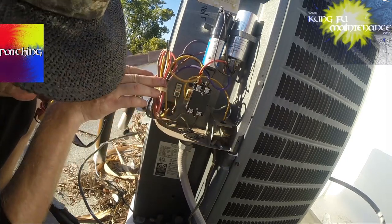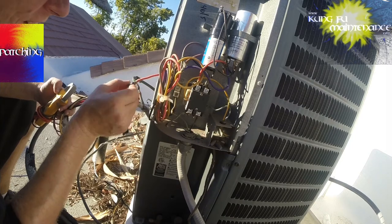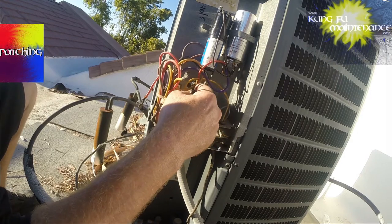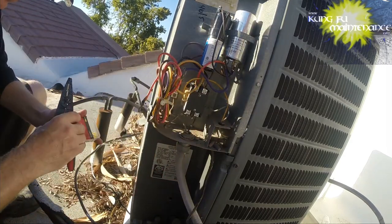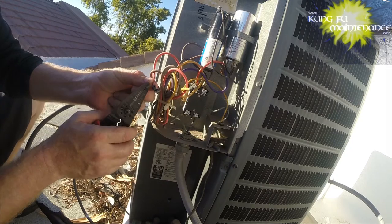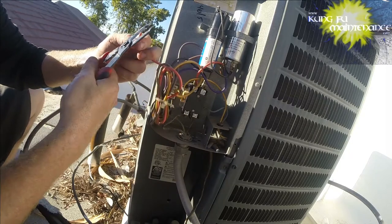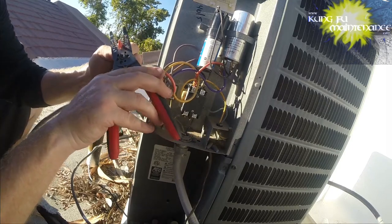Checking this wire lead, incoming wiring — a crispy feel. We discharged it, I'm letting it cool. I can replace that lead while that's going. Alternatively, we could run it straight to the front, but I've got nice wire terminals here. That's going to allow us to get rid of a little degradation because sometimes the wire gets degraded a little further back. We've got so much extra wire here — why not take it back to a really good spot, start fresh, and crimp on a really good connection.